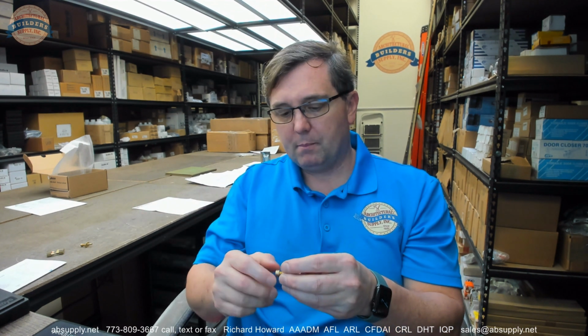In conclusion, it would be accurate to say that we are certainly not a really huge Best account because of how they bring their product to market. And unfortunately, I wish that I did a lot more business with them because I'm a true believer in the quality of their locks. They're grade 1 cylindrical, they're mortise locks. The fact that they will teach you how to pin small format interchangeable core with documentation that they freely publish is incredible. I learned how to pin interchangeable core in the very early 1990s, forgot how to do it, needed to refresh my memory, right to the Best paperwork.